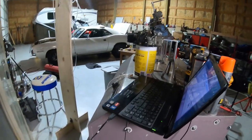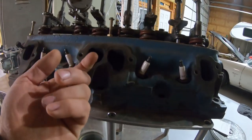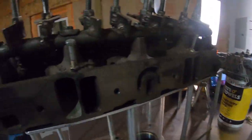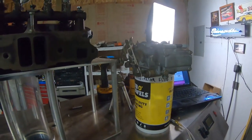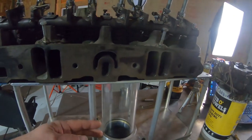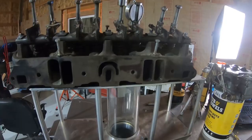In simple terms, when you have it on exhaust mode you can test the exhaust side because the air is coming out just like it does from an engine. When you have it on intake mode and I get my adapter, we'll bolt the carburetor directly on here, turn it the right way, put it on vacuum mode so the air pulls down through it — just like it does on your car.